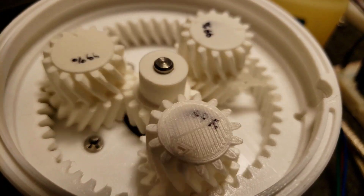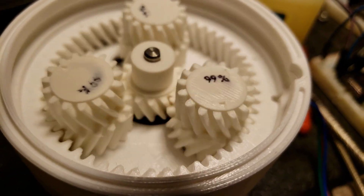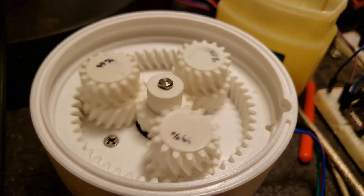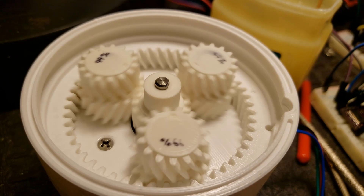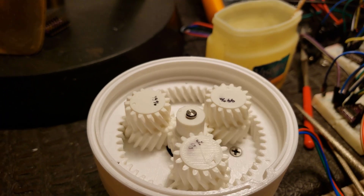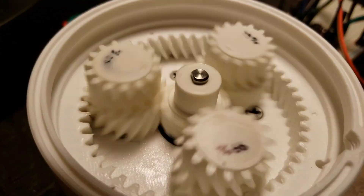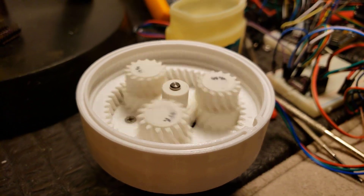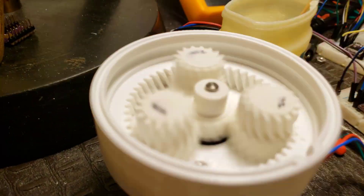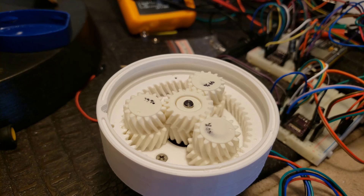You do have to do a lot of playing around here. The screws you have to assemble for this I found to be quite the task. The flat head screws in this actuator have to be flush — you need high-quality screws to make sure those fit correctly; those are M3. The robot arm was designed with English unit screws throughout, except when connecting to the stepper motors, where you need metric. Finding all the correct screws was a lot of work.